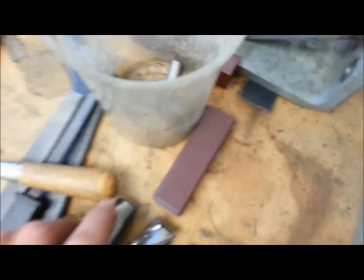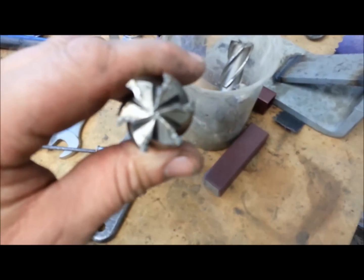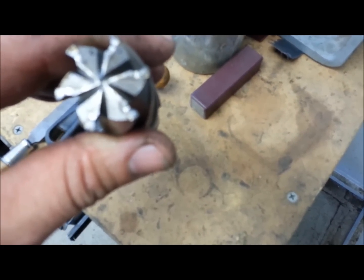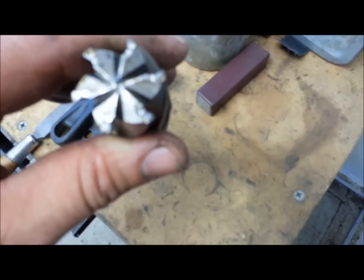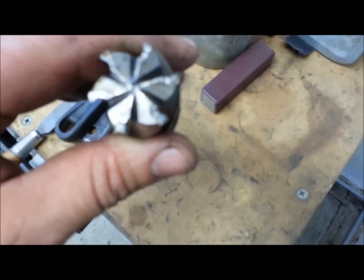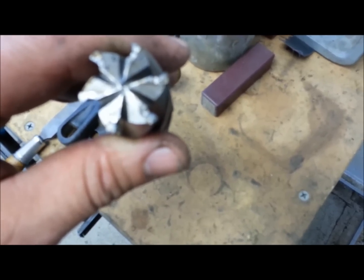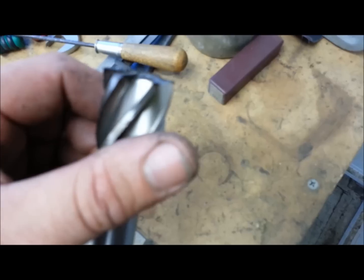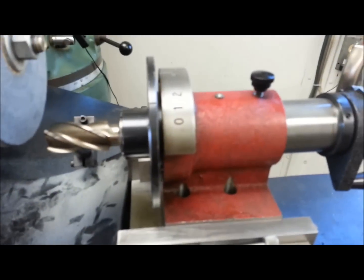I got a few more little ones in here — this is my dead end mill bucket. That one might be kind of interesting. I remember that job — I spun it up a little too fast on some 4130. I thought it was annealed but it turned out to be pre-hardened, and twisted up the machine pretty fast. Just dove in for a cut and it just melted — it work-hardened instantly, shot a bunch of hot lava out of the mill, and that sucker was done. I switched to carbide after that.